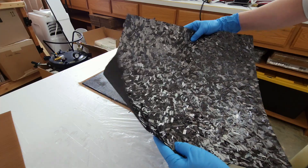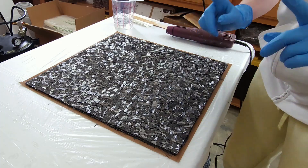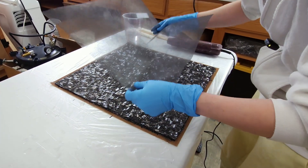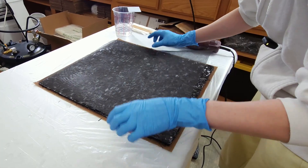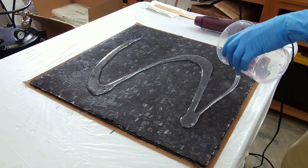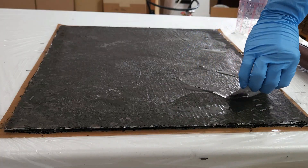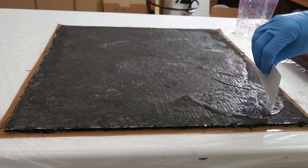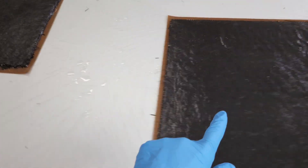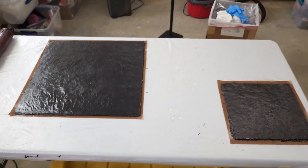More forged carbon fiber fabric. I can't put the resin straight on top of this — it's going to mess it all up. So carbon fiber veil: I can sand this off because I'm going to be sanding it anyway. Lay that on here, now I can add resin. Not just one layup but now I have two — they are different sizes because I have two different sizes of glass, but otherwise it's the same layout.